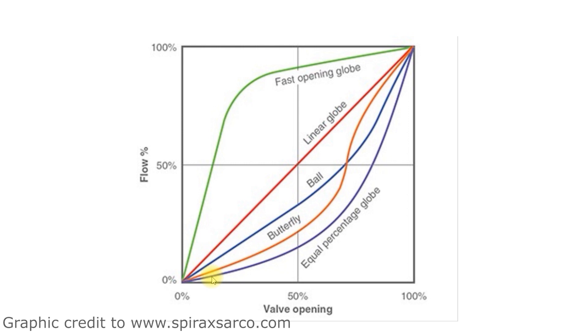What I found extremely interesting — I'd never seen the butterfly characteristic before — is this orange line, which shows the flow rate through the valve and through the coil as the butterfly valve opens. Two very interesting things: from 0% up to around 60%, the flow increases gradually, but at around 60% the flow rate dramatically increases — it just gushes through the valve — and then stabilizes around 80%. So the water follows that curve and then just gushes straight through.